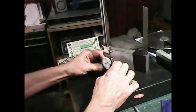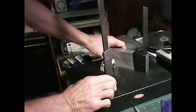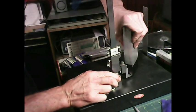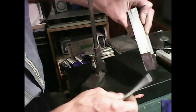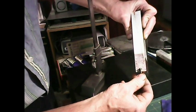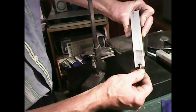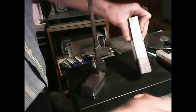There. Roughly 300 thou. And that will be the outside edge of the bushing. That should be good because I allow that head to sit right in there like that. And I better go another, yeah, I better go another 1/8.